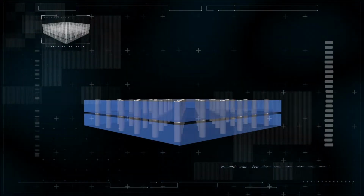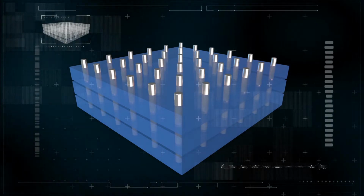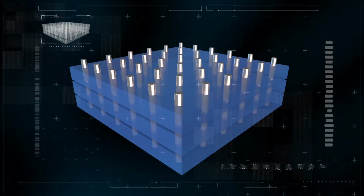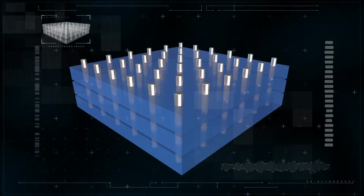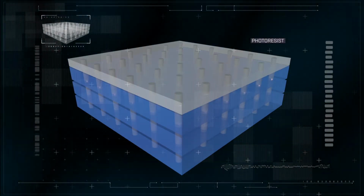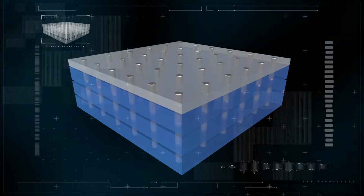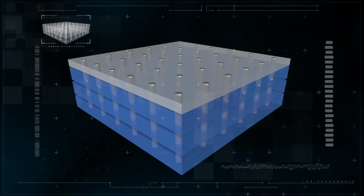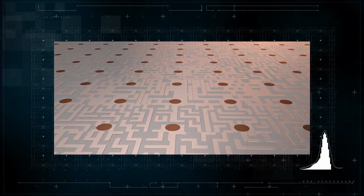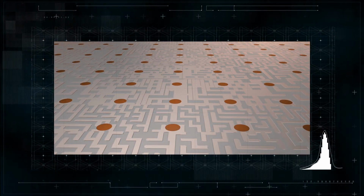Alternatively, in order to continue building up a multi-wafer stack, any remaining silicon is removed with wet processing or plasma processing, leaving a small protrusion of the TSVs on the backside of the analog wafer's surface. Silicon dioxide can be deposited to cover the protrusions, and a final CMP reveals the metal-filled TSVs. Routing and via layers can be added as required to prepare the bonded pair to be connected to additional wafers in the stack.